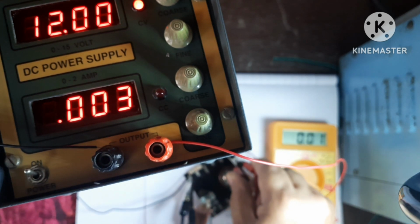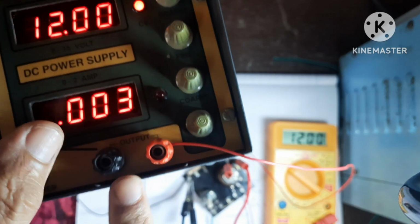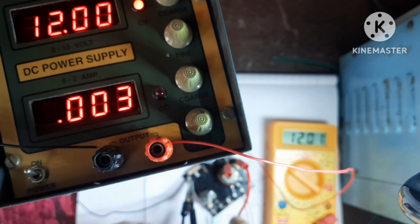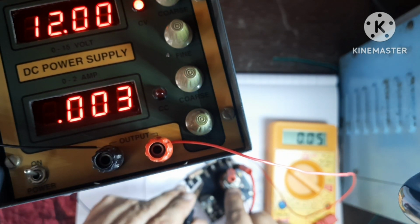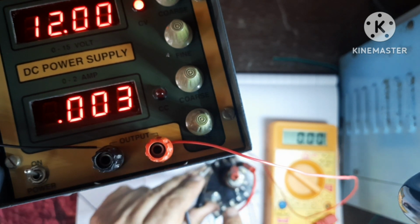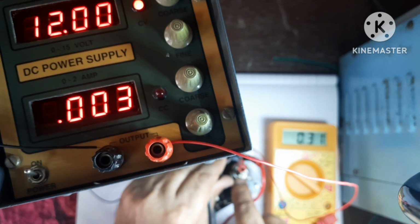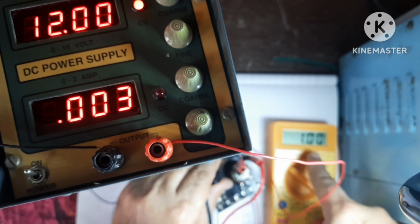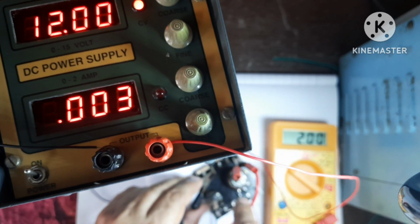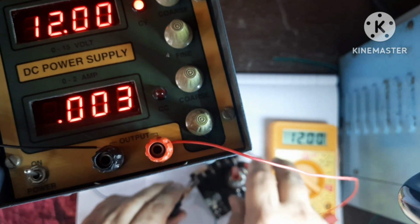And if you connect here, then since both terminals are connected to direct power supply, whatever is showing here will show here, right? If you keep this one same here and connect this terminal here now, since it is across 1 kilo, here you will get 1 volt. See, 1 volt. You connect, so see here you are getting 2 volt. And if you connect here, then 12 volt.